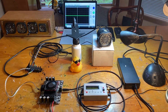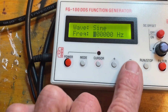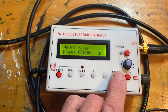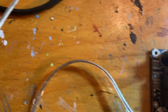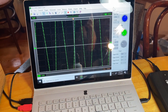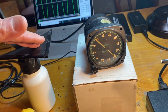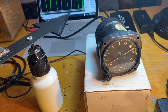Okay, let's put the pieces together, turn this thing on and see if it works. First thing to do is turn on the signal generator and set that to 400 cycles per second. Output from that comes over the audio amplifier, boosts it to 26 volts, and sends the output to this terminal strip. There's my probe for my oscilloscope, and we can confirm that we're at 26 volts, 400 cycles per second. This thing should be working — let's test it. You can see that the meter falls to zero. We are in business.